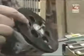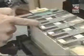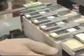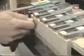The next tool is this router. It has a dovetailing bit and it has a little collar right here. And that collar rides around these fingers and these pieces of wood. And every time it goes in, it cuts out one of those tails. Now I like to start from this side and make a scoring pass to minimize the tear out, and then finish cutting the tails.